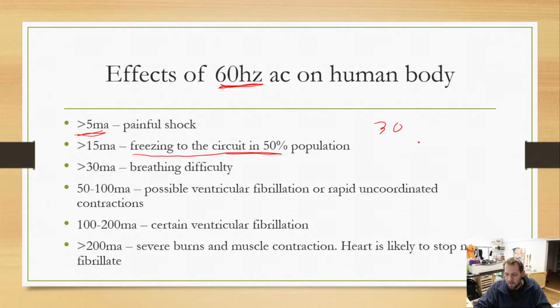The other thing they'll tell you when you're dealing with multimeters is the one hand rule, which means only touch the circuit with one hand. Never have a black probe in one hand and a red in the other, because if something happens, now you can become the path of electricity. So oftentimes you'll want to clip the black wire to something and then probe with the red wire, so there's in theory not a complete path of electricity if you accidentally shock something. So you want to be very careful of that.